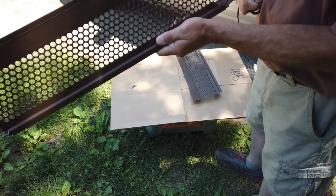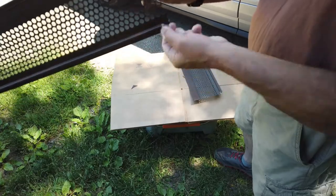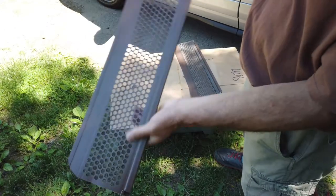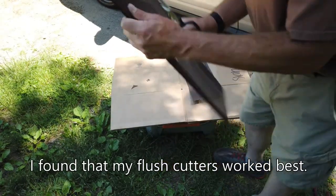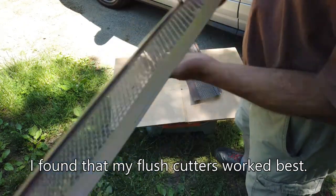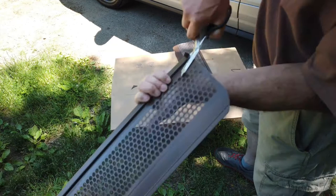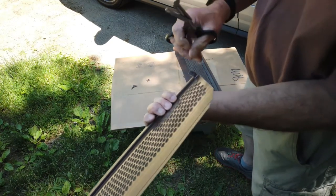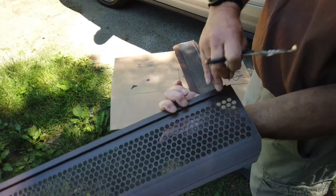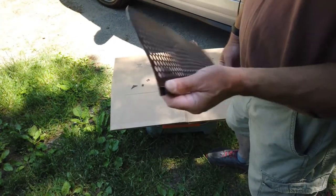As best I can, I'm going to trim that just a touch with the shears so I've got just this little lip. You can actually just wiggle it off and it'll come off. I'll go back in and trim this with a knife. Same thing on the front leading edge towards the driver's door — I'm working on the driver's side. I'm trying not to overcut; I don't want to go too deep so my cuts aren't exposed to the outside. Now it's trimming time.